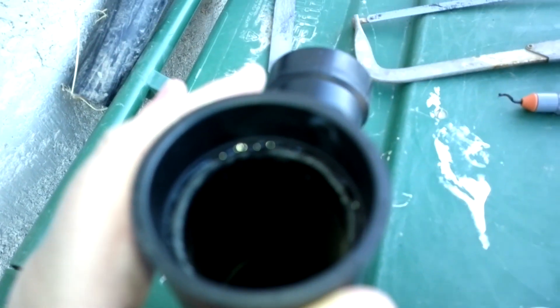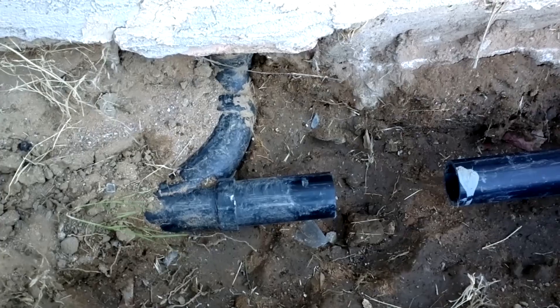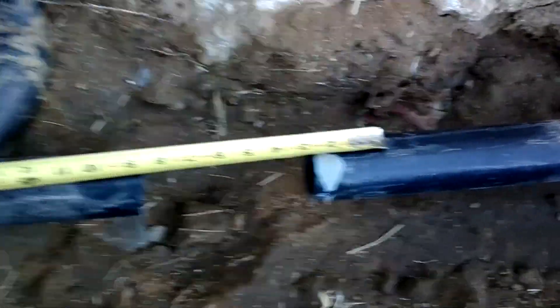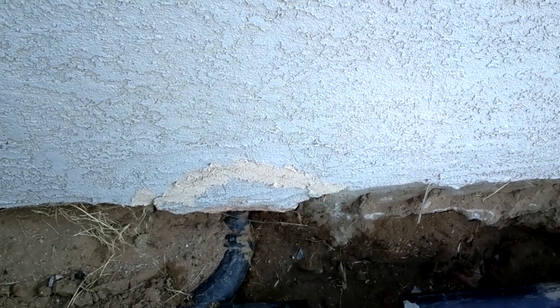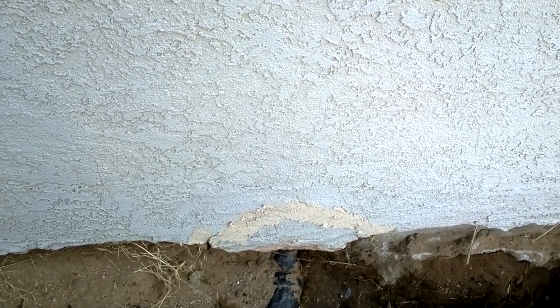Alright, now as you can see in there, you see that glue right around the rim there — that is a good seating. Now back over here on this part. I measured the other part and did a little bit of math. I figured what I need to do is cut off a gap of 8.75 inches — so I'm going to mark that here. I derived that number from taking the overall measurement of the apparatus we just created and subtracting the inner measurement — there's an inner lip on those parts, about three-quarters of an inch each side. So it's 10 and a quarter total, minus 0.75 and 0.75, which gives me 8.75.